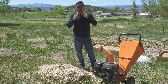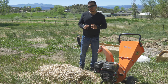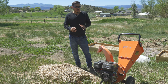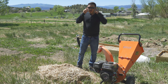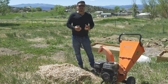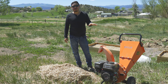Make sure you're wearing safety glasses, because as you're throwing twigs and sticks through it, it's kicking things back. A lot of times when I'm throwing bigger branches in, I turn away as I throw them in because it'll chew a piece out and little pieces come flying out of the chute right toward your face. In addition to safety glasses and gloves, I experimented with using my AirPods Pro in noise cancellation mode — they're actually really good for this machine. I can still hear everything going on without the volume being overly loud.